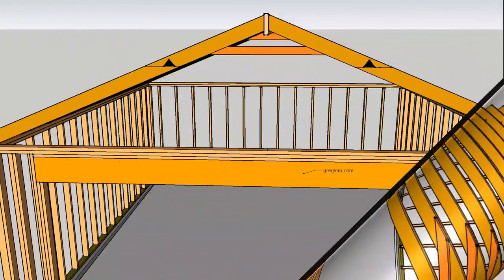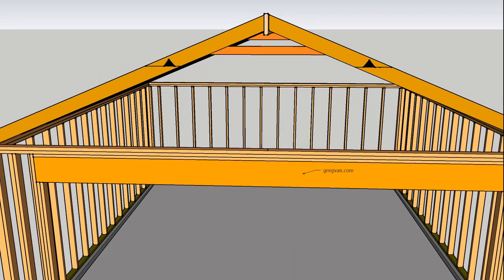To give you a better idea, we can take a look at this illustration. You can see where I drew some arrows in on the roof rafters pointing up — this is the upper one-third area. For example, if you measured from the top of the wall framing plates to the top of the roof ridge and had a distance of 48 inches, the collar ties would need to be placed in the upper 16 inches of the roof.